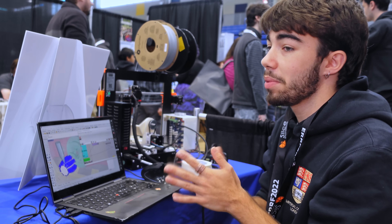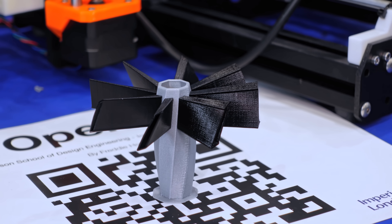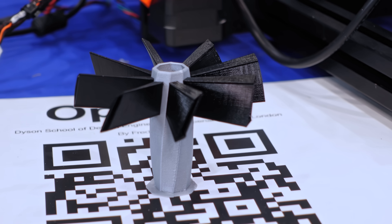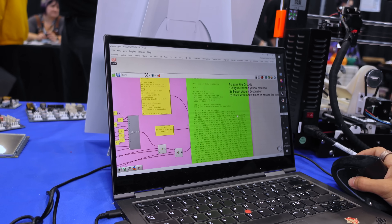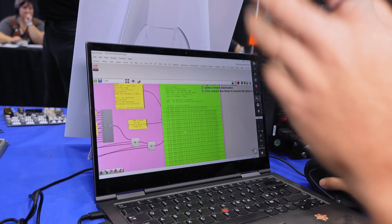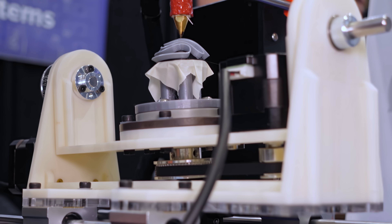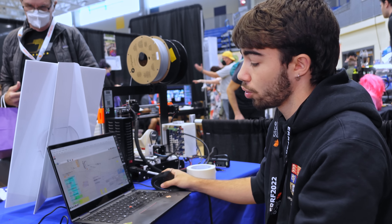The path can be generated in different ways — you can do it manually if you want. For the propeller, I made the substrate, attached a rectangle to it, then using Grasshopper I sliced that rectangle and made a continuous path — like a vase mode. This is the G-code file you end up with at the end: start G-code, temperature, other settings, and end G-code. The only drawback is that Rhino is not open source, so you need a license for Rhino and hence for Grasshopper, which is the current open source limitation.